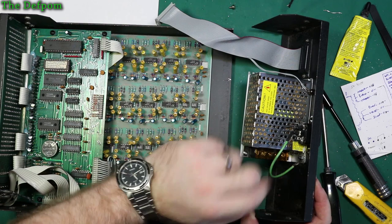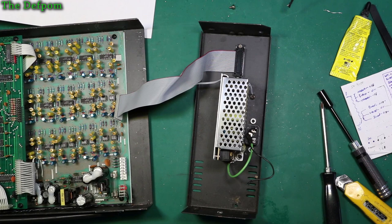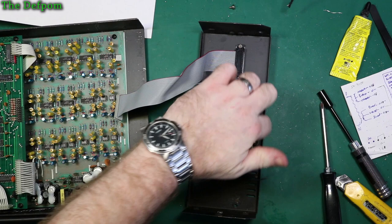Neutral and phase going to those. Actually, black, that's a black one. I thought it was back to front. I was thinking it wasn't right. This black wire is actually the phase. Right, it's also an American wiring colour scheme. I thought it was weird, it's switching the neutral and having a fuse on neutral. Nah, because of the colour scheme, that is live. I'm looking at the plug, I'm thinking actually no, that's the live pin over there.